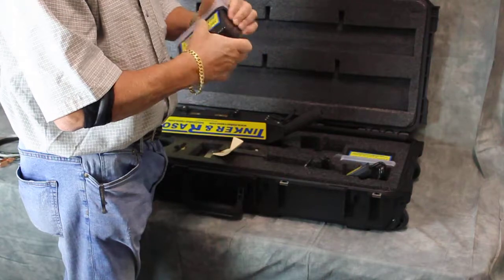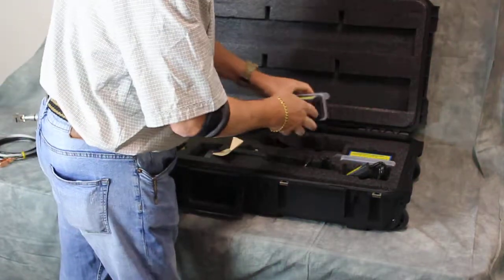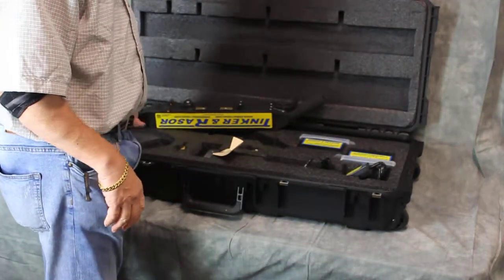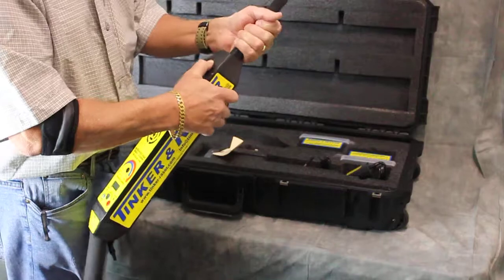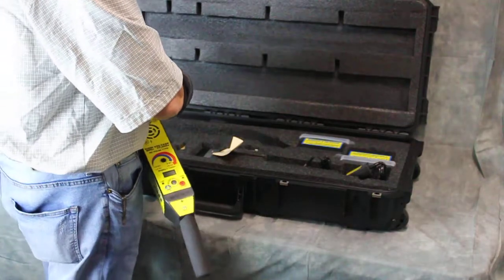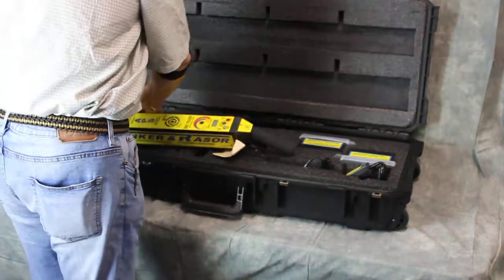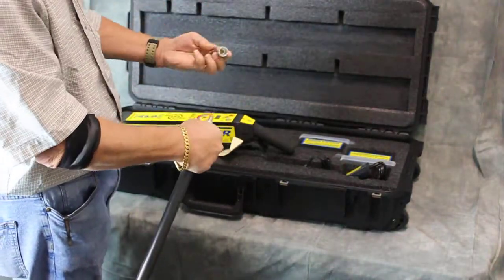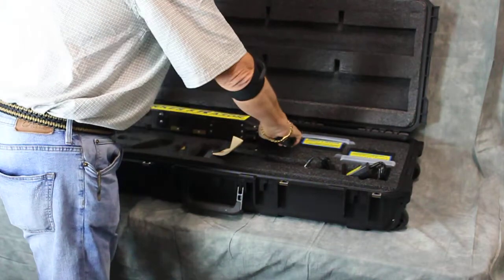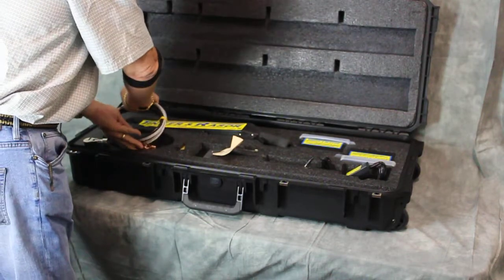Repacking the unit, we always want to make sure that we put the cover back on the lithium ion batteries. These lithium ion batteries come with a special circuit that doesn't actually allow them to short out — the battery will go into a dead state before that happens. Importantly, the cover makes the unit now shippable internationally without any questions. The wand handle comes out, the Compax connector comes off, the handle goes back into the bottom of the case, holiday detector on top, and the ground wire back into its position.